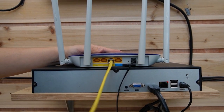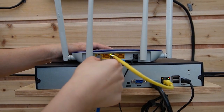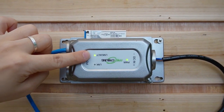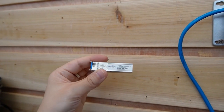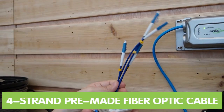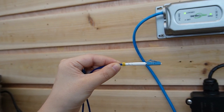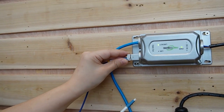Let's use an Ethernet cable to connect our router to the NVR, and another Ethernet cable to connect our router to the outdoor media converter. Now this is the power supply unit for the media converter — let's plug it in, and we can see the indicator light is on. Now we need the SFP transceiver, but it's usually sold separately because it depends on what kind of fiber optic cable and connector you use. Today we are using a single mode, four-strand fiber optic cable, and since it's pre-terminated, we don't need to worry about the connector — it's 100% tested in the factory. Let's use strand A and plug it into the SFP transceiver, then plug it into our SFP slot.